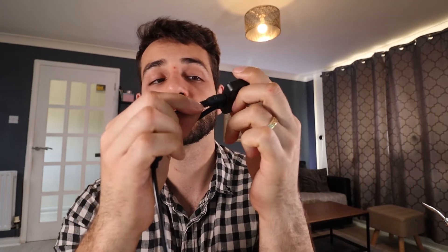These adapters are ones that you can connect a 12-volt supply to. It means that if you have a power supply, you connect 12 volts and it will work with a 3.5-inch hard drive. Or if you only want a 2.5-inch drive, you can disconnect the power and sort it. If you need more than one hard drive adapter - say you have 2, 3, or however many hard drives you want to connect - you need a splitter. You have one 12V input connection and multiple output connections. This type is normally used for CCTV, but it works really well.